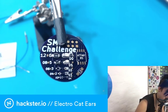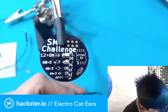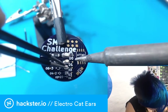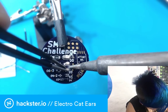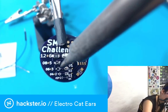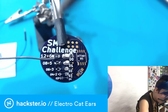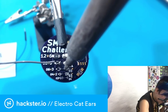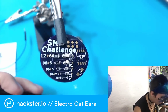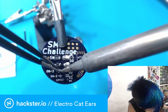The right side is positive and the left side is negative. Let's go. It's getting slipped around. It's definitely very tombstone there, but I think that's because the other side is kind of spiky — I did not do the greatest job of tinning. But whatever, it's going to be in a little enclosure. I'm just going to connect it like that. I'm not getting graded on style, so who cares. You probably care — someone is definitely going to say, 'I care!' And you know what? You're right. You should have aesthetic standards. But right now, I don't.